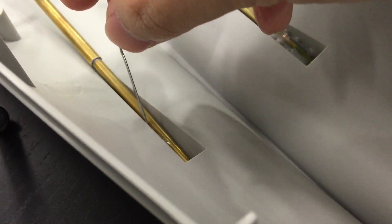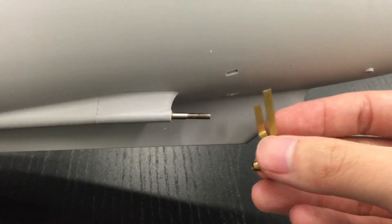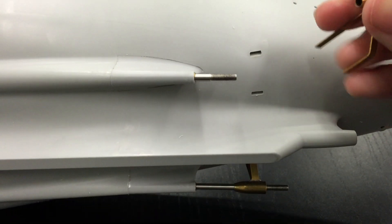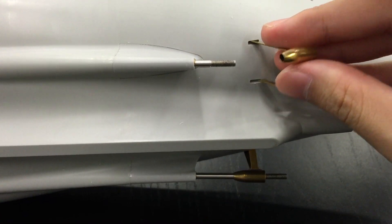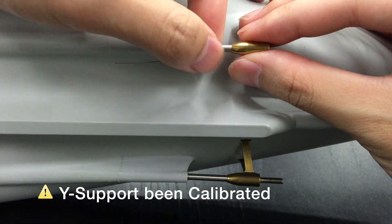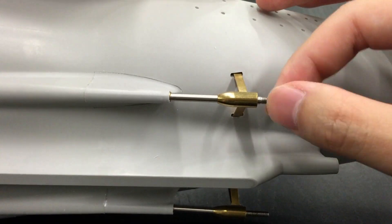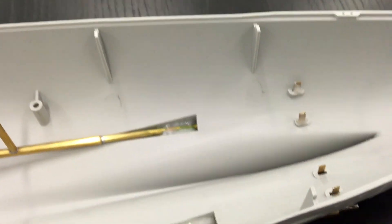Wait for a while for solidification. Now we can replace the plastic spur gear with the brass one. The coordinate precision is already locked by the shafting box, but for pure glue assembly, a small portion of epoxy may allow you a chance to adjust the precision.